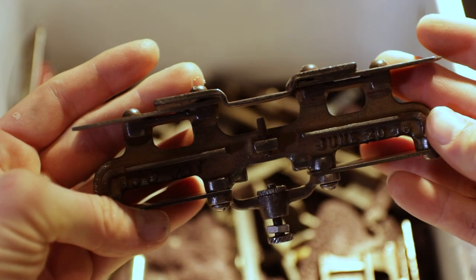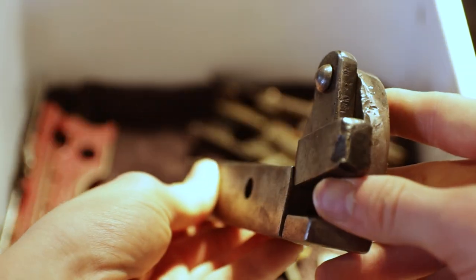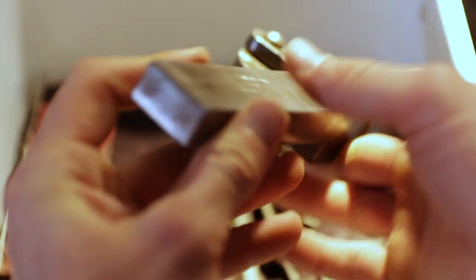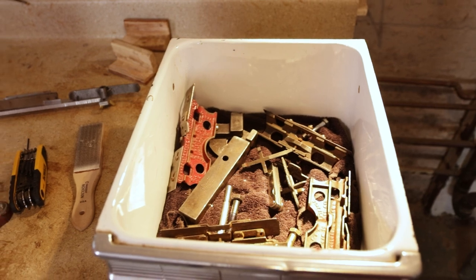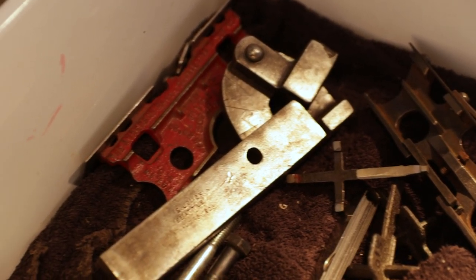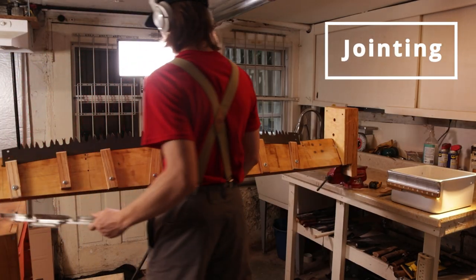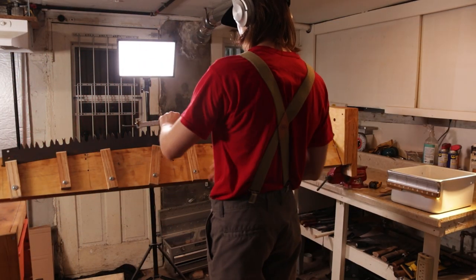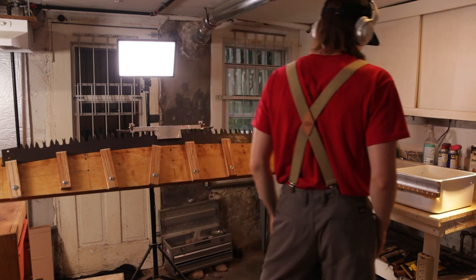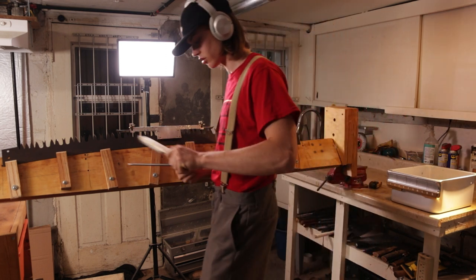So these are my combination tools. There's a raker filing plate on some of these, there's a pin gauge, there's a jointer, but I use a sloped filing plate for my rakers and then I use a long jointer for the jointing process. And lastly, I don't set by hand. I use this setting tool with a spider — I think it's a Morin — and it's really nice. It helps me with accuracy and it's really efficient if you have to set a tooth a lot.